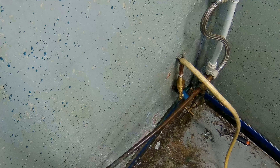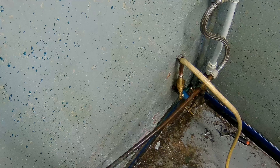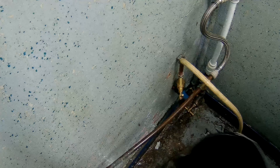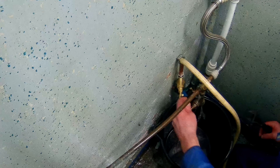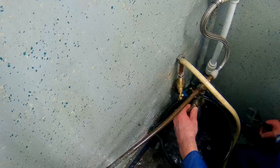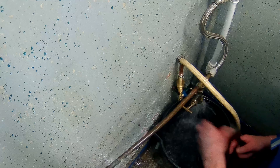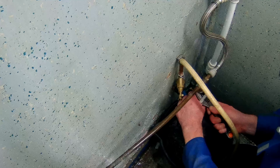The bucket is full again, just to take any water dripping out of the system. The water is dripping from the newly fitted stopcock because the hose fitting on top is loose — not worried about that. I come back with the bucket, put it underneath the old stopcock which is still on the old pipework, and turn it on to drain the water — and it comes out at force. I'm now thinking that's not right; there shouldn't be that much pressure with the tank only about 15 feet up in the roof space. At this point I've figured out that the other pipe coming out of the floor is also an incoming mains. Two incoming mains — who knew!